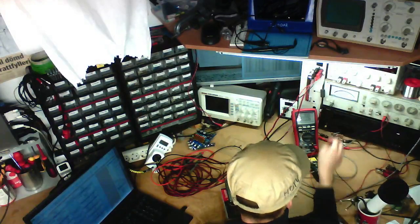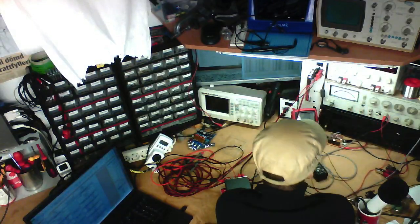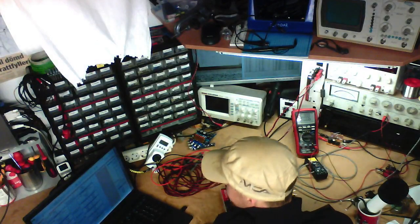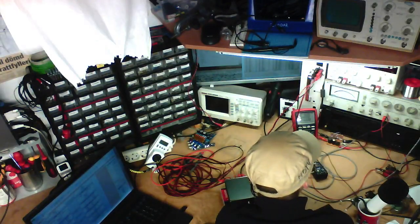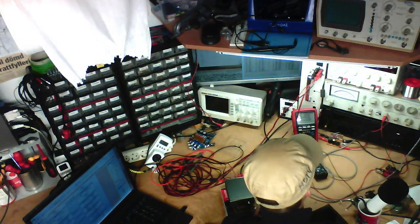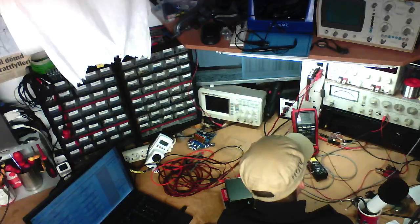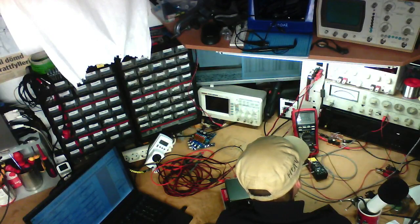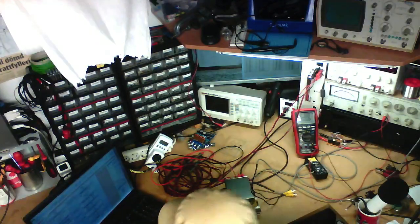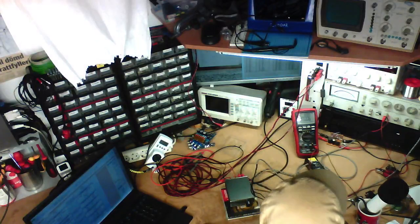So what do we have? Unweighted noise floor of. Should I? Yeah, I think I should. I don't remember how my spreadsheet works. I don't remember if I'm supposed to enter in negative dBV or if I'm to enter it in microvolts, but I think it's microvolts. So we'll try. We've got 250 microvolts. Yep, that worked, and that's minus 72.04 decibel volts.